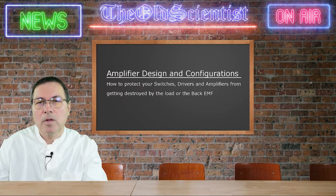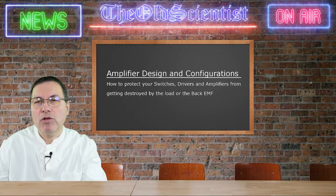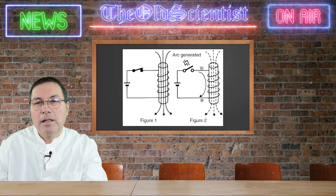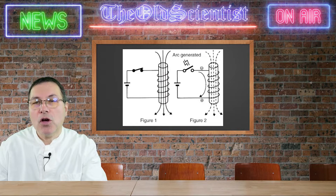Hello and welcome. A common problem when we close the switch for a relay, for example, is that when we open the switch, the stored energy in the coil is released, causing arcs to appear. Here is a picture of the process. This happens with every coil and its strength depends on the core material which can store the energy.